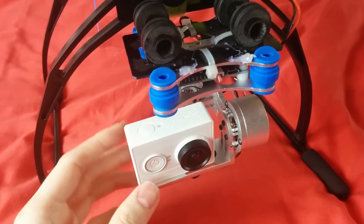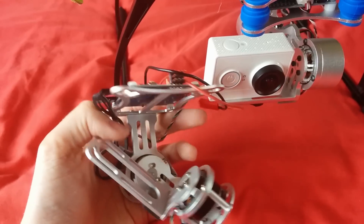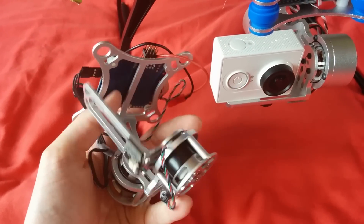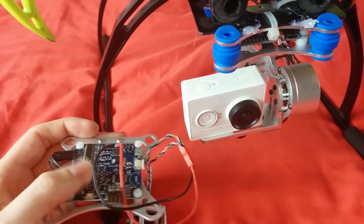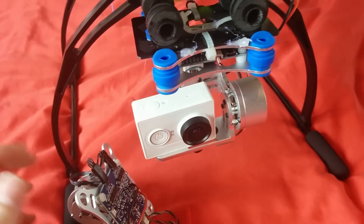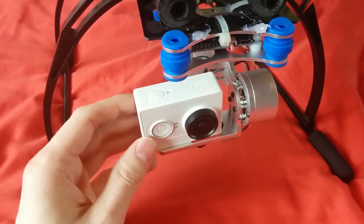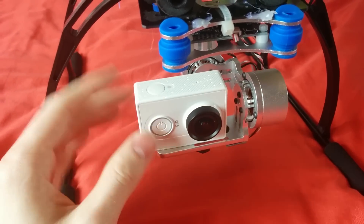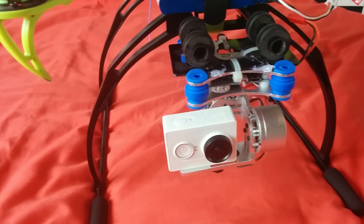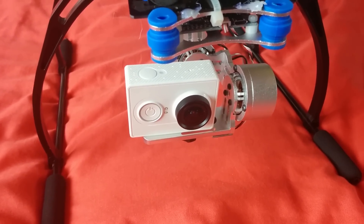In conclusion, I'm going to stick with the cheaper one — it performs better and I didn't have to change any settings. The more expensive one is of no use to me; yes it's lightweight, but if it doesn't work that's no good. The one thing I'm taking away is that its board does seem slightly better, so I might swap it into the cheaper gimbal and end up with a really good combination. Gimbals are a bit of a mixed bag — not the easiest to set up, and a two-axis gimbal will still have some shake because there's no yaw stabilisation. I guess the next thing is to try out a three-axis gimbal. Thanks for watching, please subscribe!